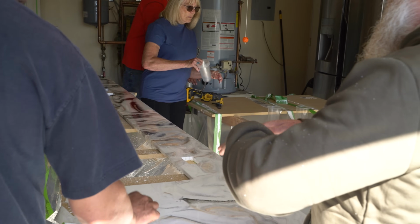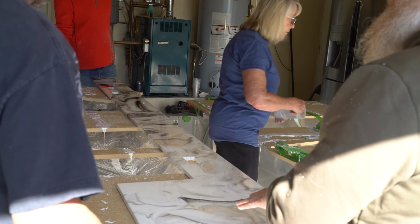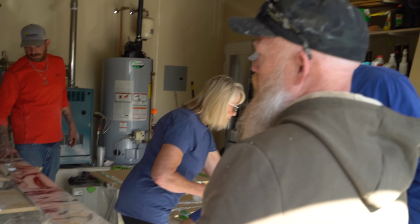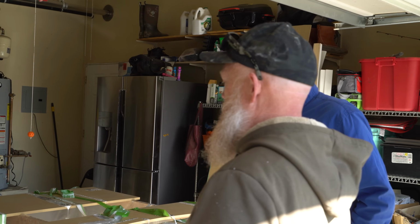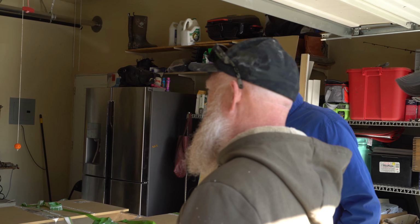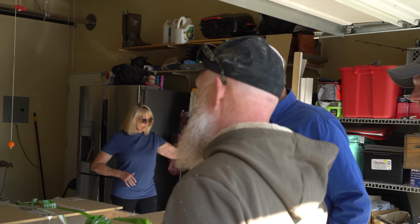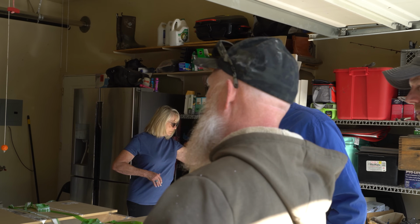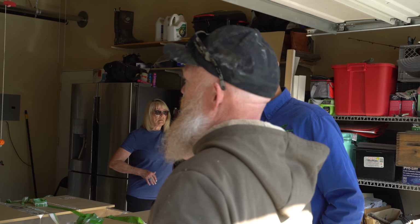But I have seen seams that weren't done with epoxy. I used to biscuit joint my seams, and wood glue and biscuits are not nearly as strong as just epoxy butted up. An epoxy seam will never break, especially if you do it with a countertop and let it cure overnight. I've never seen breakage, but I have seen where you crease it and it leaves a permanent ripple through your top that you can't get out.